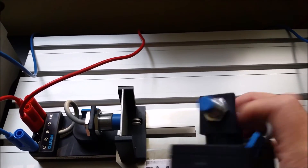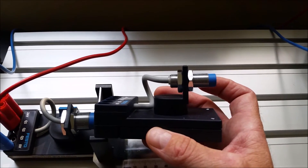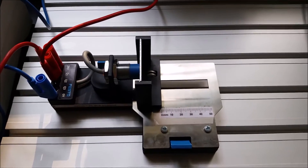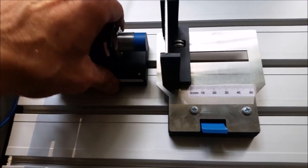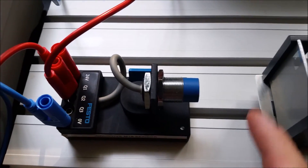The other two inductive sensors: this one is the M12, the smaller one, compared to the M18 over here. Both are non-shielded, meaning the threads don't go all the way to the end. There's no way to tell whether this is an inductive or capacitive sensor without hooking it up and testing it, or looking at the cut sheet. The number I was referencing is on the back: 548643.